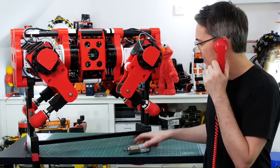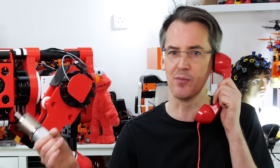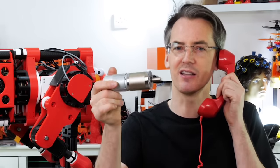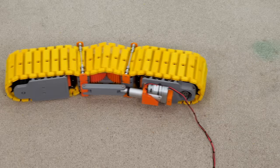In this video I'm going to design a cycloidal drive using a DC brushed motor that already has a gear head on it, and if that goes well then I'm going to use that in some bigger projects coming out this year, probably in the summer. In a couple of projects I've built with similar motors I save space by putting the motor inside the wheel hub — so what if we could do this with a cycloidal drive? What if we put this inside the cam that actually turns the cycloidal discs?